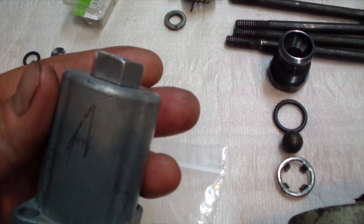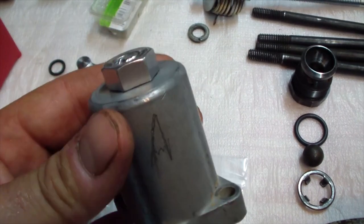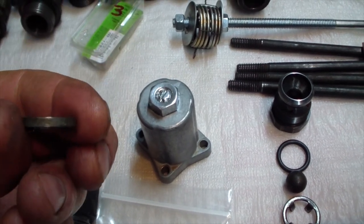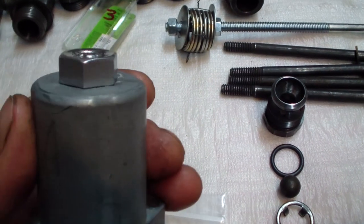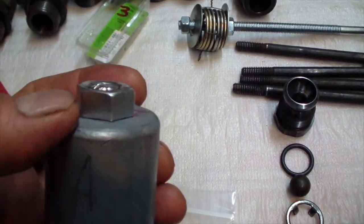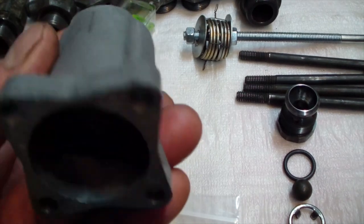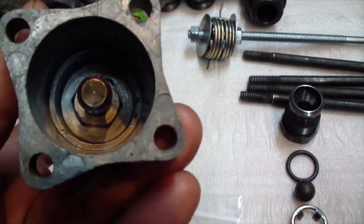This one here, I didn't have to machine this special bolt. They use a lock washer, it's a very thick lock washer. What I did, I replaced the lock nut with a full, heavy nut, and it's engaged by about 3.5 to 4 threads, and I use Loctite. And I think there is an intention for this.